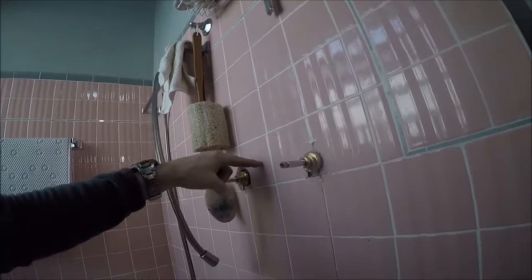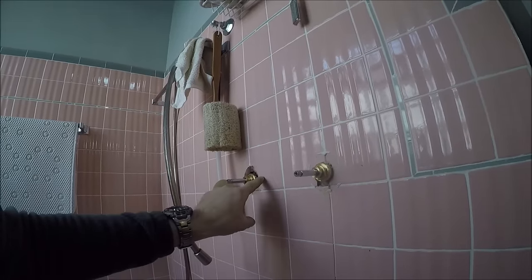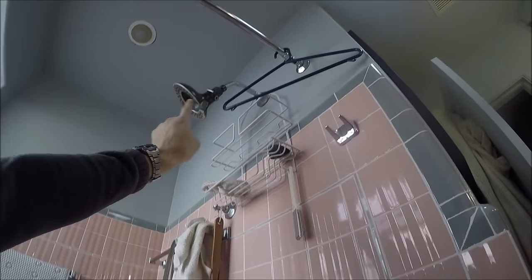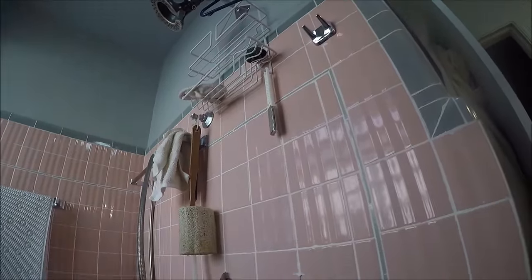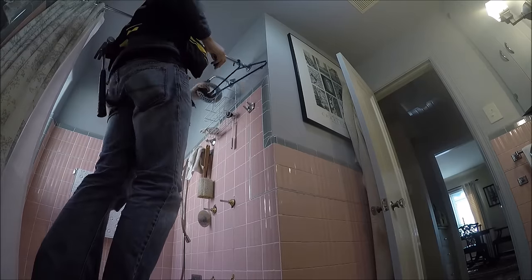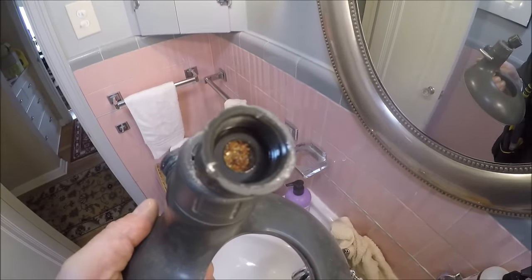The valves in the back — when you screw this down and tighten it up — that's designed to hold full water pressure. So what's happening is when I open these up, full pressure goes up there and then stops, and these packing nuts are then trying to hold back full water pressure. You can see that it's all packed full of rust bits. And that's why we've got water coming out around our packing and why we don't have water coming out up there.